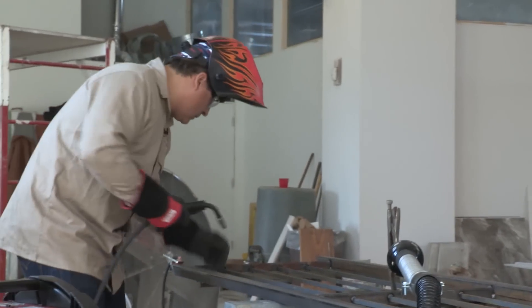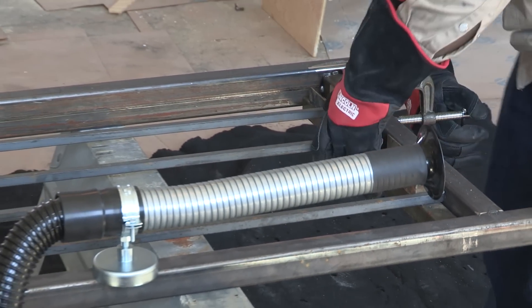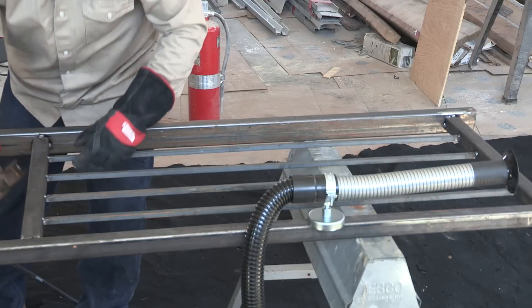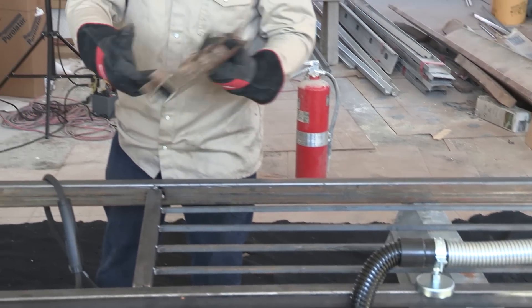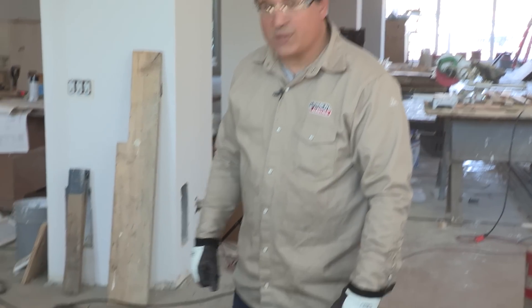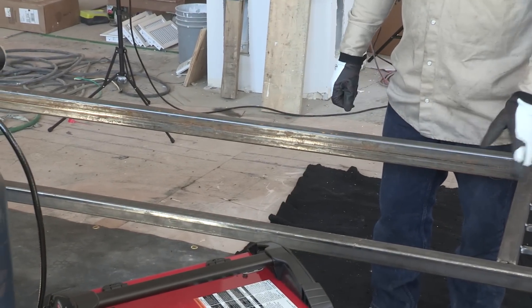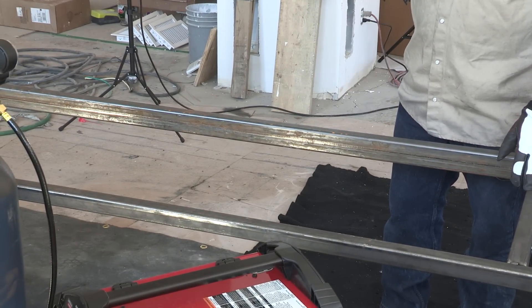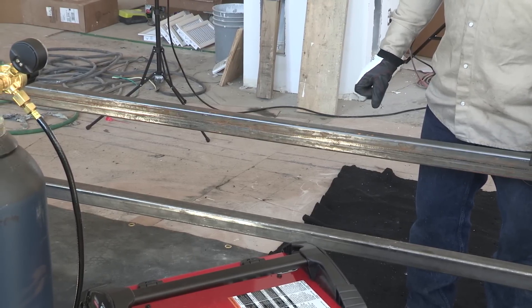I love this welder. So we're going to take the jigs off — you just got to make sure you don't weld into however you make your jig, because then you're going to be grinding it off. So I just finished tacking up the first section of the half-inch stock. We're going to move into the second section — I'm going to clean off the bar stock again, set up the jig, put the pieces in there, tack them in. Then we'll do the last section and start welding. Once everything's in place tacked, we can go ahead and start welding so it will not move.